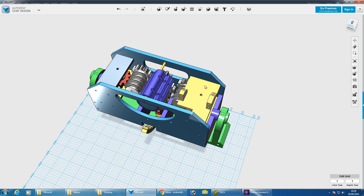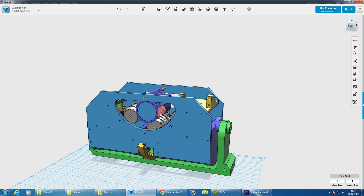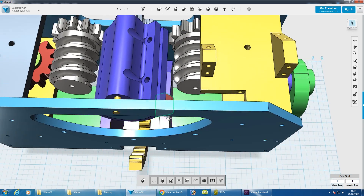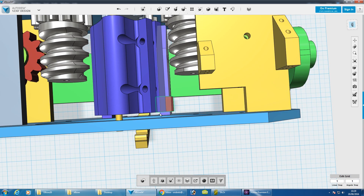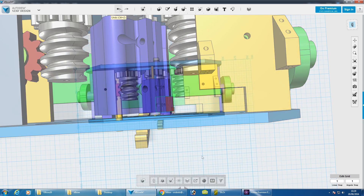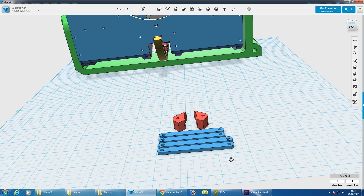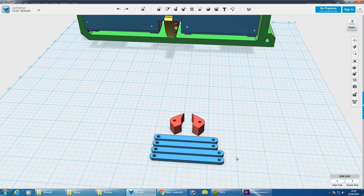Here's the CAD so far with that plate fitted. I've also made this little piece which is going to be solvent welded to the motor bracket to allow it to be pushed by the servo. I've got a little gap down the side there which should be exactly the same distance to where the end of the servo horn is, so we can get the lever in. Here are my parts ready to be printed — I'm printing the two opposites and servo rods to push it in different lengths.